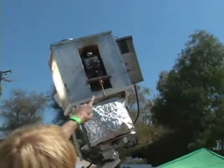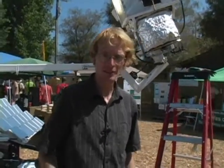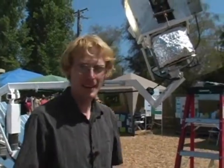And the temperature inside, you get a picture right up there, it looks like we're 445, 446, which is good. The coffee roasting temperature we like is around 450 to 500, so we're just bringing it back up, and we can turn out a roast in about 20 to 25 minutes, and we can preheat in about 10, so we can roast probably 7 pounds every 30 minutes or so.